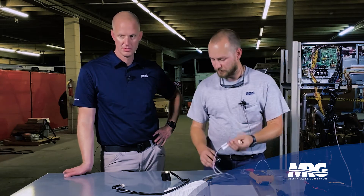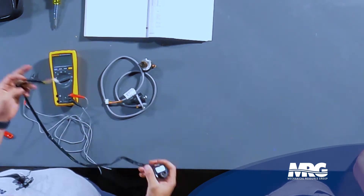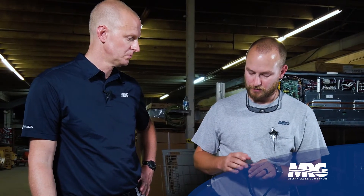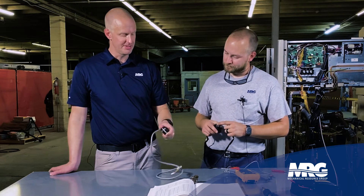The next type is the bolt-on style, which is most commonly found on VRV3 outdoor units and on pretty much every indoor unit. During maintenance of the outdoor units, take this thing off and inspect it for cracks through the black plastic housing. If you see any kind of cracks, this component has lived out its life and needs to be replaced.